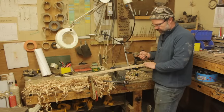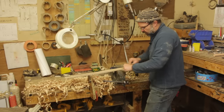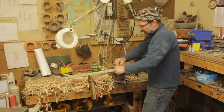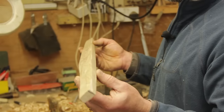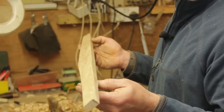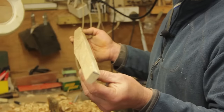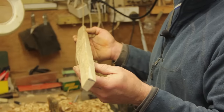I'm just chasing down that growth ring, making sure I've got it as good as I can. The timber obviously moves slightly so you've got to work with it. I find a spokeshave is better at this point because you can move it with the grain of the wood — when you see that you've got to dip down here and then swoop back out, it allows you to do that. This is not a piece of MDF or chipboard — it will not bend to my will. I have to work with the wood itself.